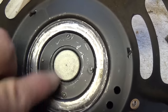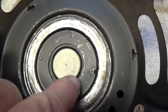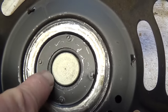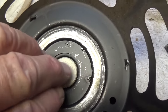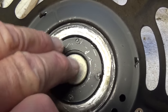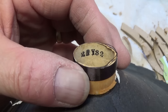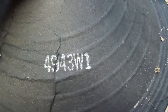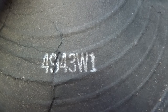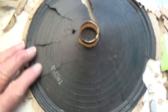After using several different shims and several sessions with the air compressor, look down with a bright light and make sure there is absolutely no residue — no little tiny metal flakes or anything like that down inside this gap. It has to be almost surgically clean. If you haven't already ordered your re-coning supplies, there'll be numbers on the voice coil — 28Y32 — and a number on the cone itself — 494-3W1 — that can help you find exactly the right materials to re-cone your speaker.